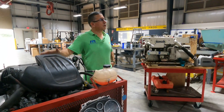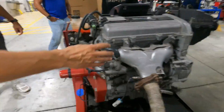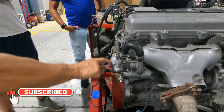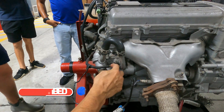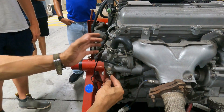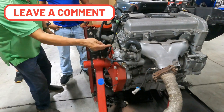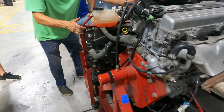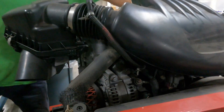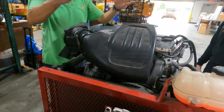This is a traditional gasoline engine. Let's check the components: the exhaust manifold, the oxygen sensor, and the thermostat housing — the thermostat is located here. We have the coolant temperature sensor and coolant temperature switch, both in the same housing. The block, exhaust manifold, coolant radiator, and coolant return circulate back into the block. When the thermostat opens or closes, this is the flow of coolant to keep the engine cool.